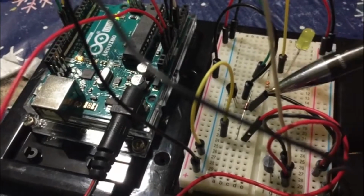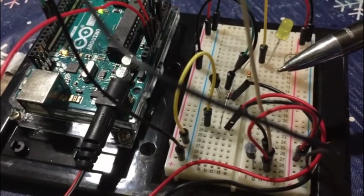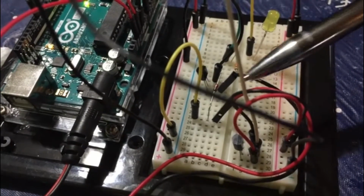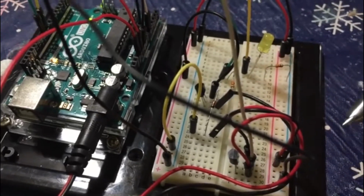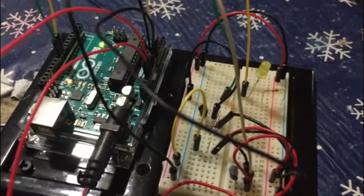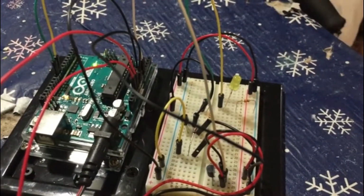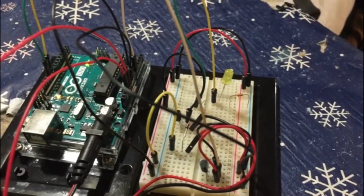Okay. Yeah, the book said that electricity is like water and that it will follow the path of least resistance. That's correct. And so you have to have that diode in place because the motor draws so much current that it'll go somewhere else. Sometimes when the motor turns off, you'll get a surge and it'll backflow and it can burn stuff up. A spike. Okay, spike. Normally, it's like the electricity is going along, driving along real good, and then you stop it, it kind of backs up and runs up. Oh, I see.